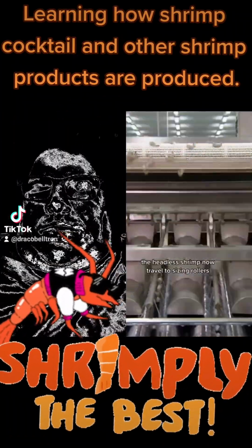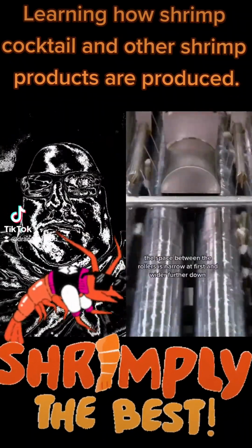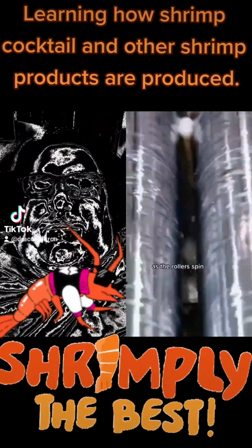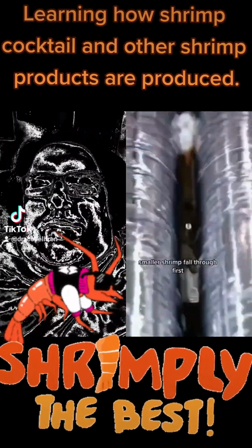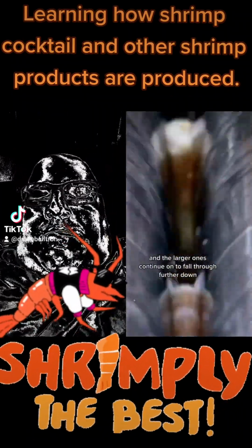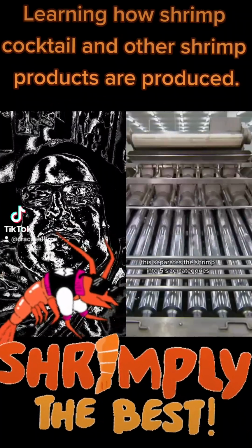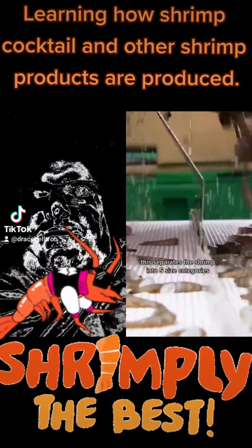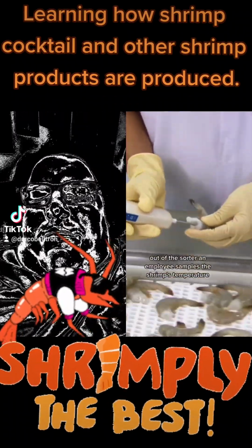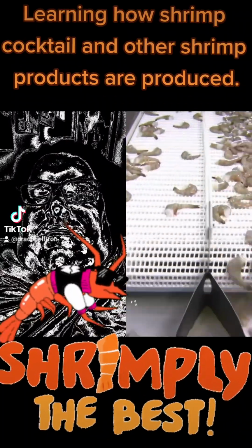The headless shrimp now travel to sizing rollers. The space between the rollers is narrow at first and wider further down. As the rollers spin, smaller shrimp fall through first, and the larger ones continue on to fall through further down. They accumulate in different piles on conveyors below. This separates the shrimp into 5 size categories. Out of the sorter, an employee samples the shrimp's temperature to confirm that it remains adequately chilled.